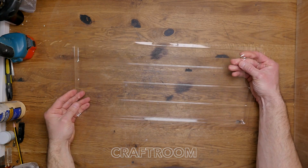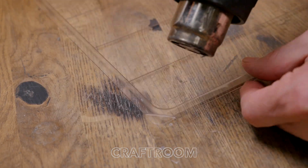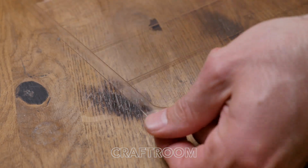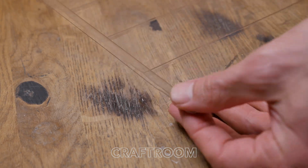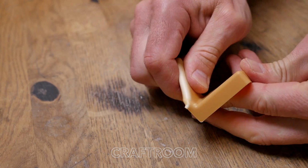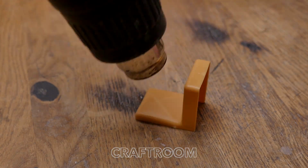This property of plastic to recover when exposed to temperature may be very useful to you in other cases. For example, here's a plastic drying tray that accidentally was bent in transit or anyways. Take a heat gun and gently warm up the bend. And plastic restores its original transparency. It's well visible on the plastic corner. We bend and white creases appear. Then they disappear when exposed to temperature.